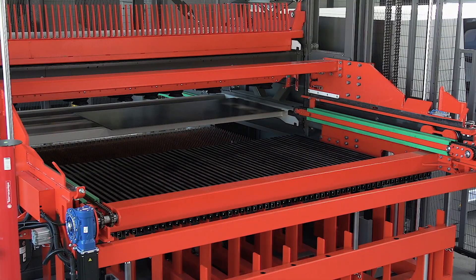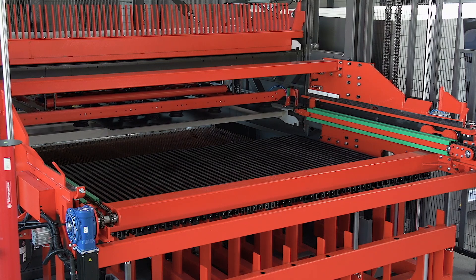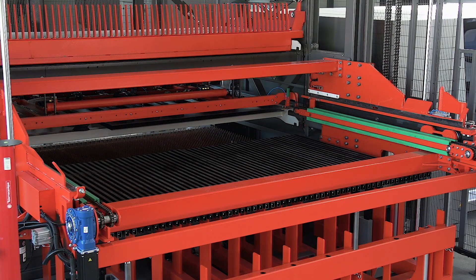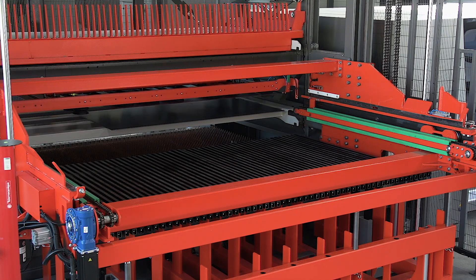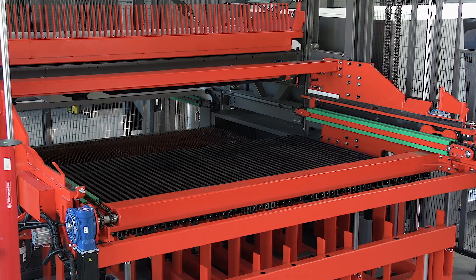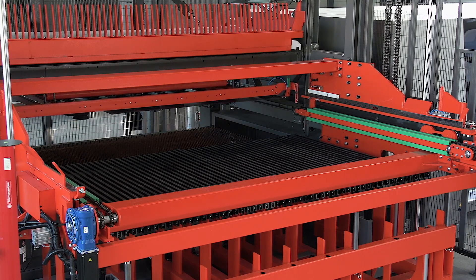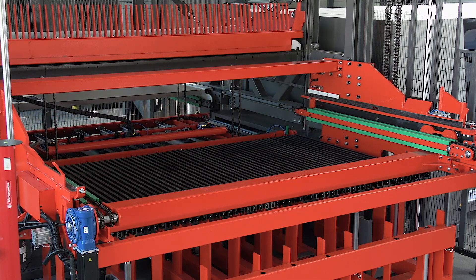This is the sheet loading process on the laser shuttle table at the start of the job list execution. The single sheet is loaded on the external shuttle table position by the means of the vacuum unit. This system is equipped with the fast cycle option: the loading cassette can slide backwards so that the vacuum unit can reach the laser shuttle table.